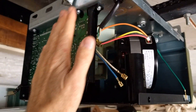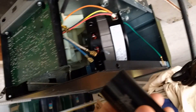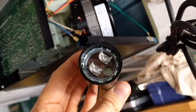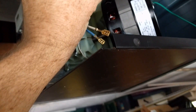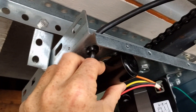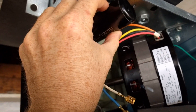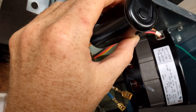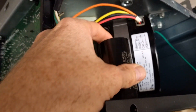There's a panel here that comes off, and then the capacitor looks like this. It's got two terminals with four prongs on it, and that was a little bit tricky to get off. It sits up under here — there's a bracket that holds it on. I had to take the entire bracket off; I was hoping I could just sort of slide it out.